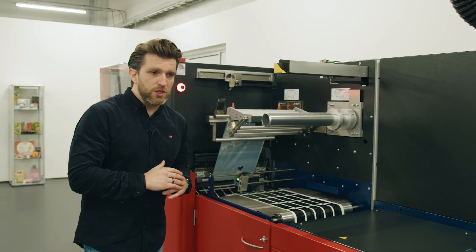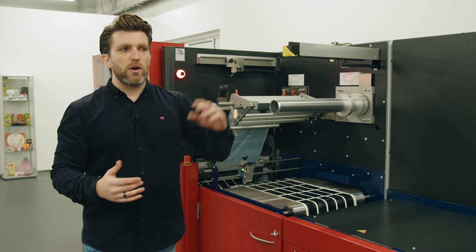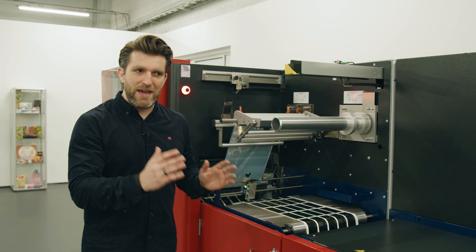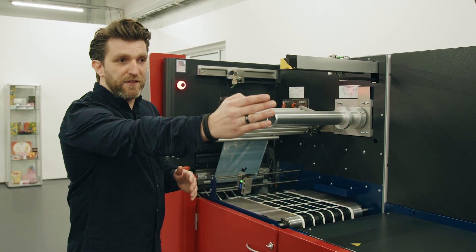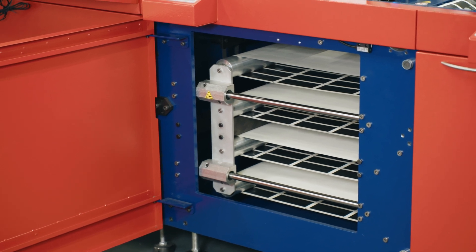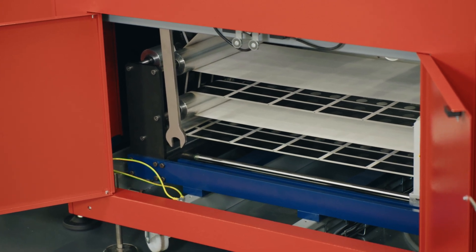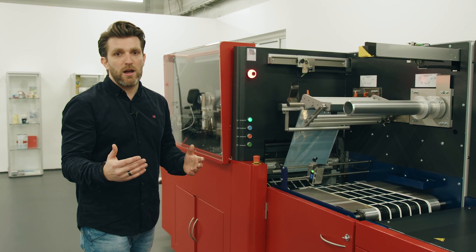What's also very important is that the FEU is digital — and it's not only about having no tooling or fast changeover times. Setup is very important too, and that is why the FEU is equipped with three buffer stations: at the flexo printing, at the UV inkjet printing, and at the foiling station. These buffer stations enable the operator to print one image, go back, evaluate, adjust, and go on — an ideal situation to reduce waste while setting up.